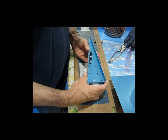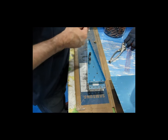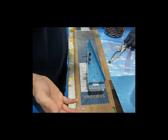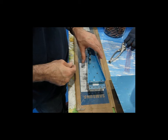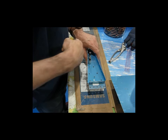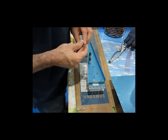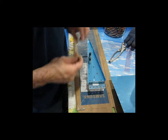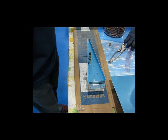And the other thing that I wanted to mention real quick, in the video showing me drilling, you may have noticed I didn't have any gloves on. 99% of the time I wear gloves around the drill press, because if you're holding on to a part, something were to catch and it were to swing, it's going to waste no time cutting your hand or cutting your finger. So I like to wear gloves. I just didn't in that last clip, but I would recommend doing so.